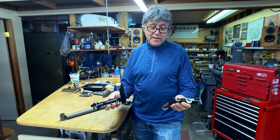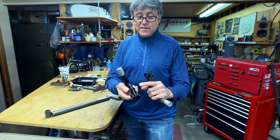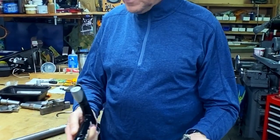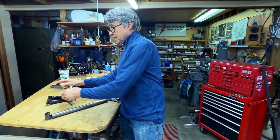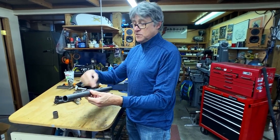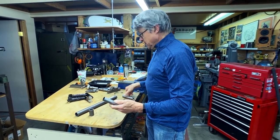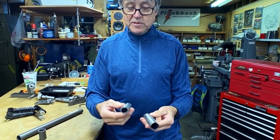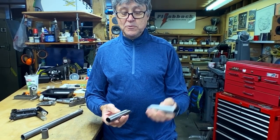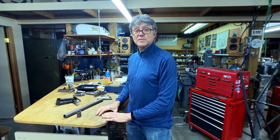Here's a couple of oldies. I started making stems back in 86 when I started Rody Bikes. This one has ICR — you can see where the cable goes in and the cable comes out. So that's what we'll be making today. These are the pieces; it's chrome moly. We've got an extension tube — this is too long — a clamp tube and a quill tube. These are the two sizes of the quill tube: this is for an inch headset, this is for an inch and an eighth headset. So we're going to use the smaller one for an inch headset, old style.